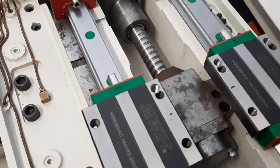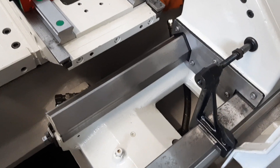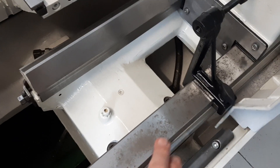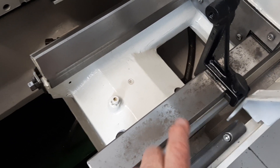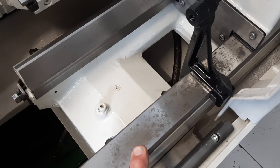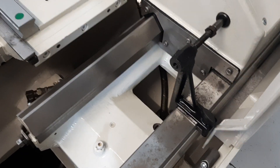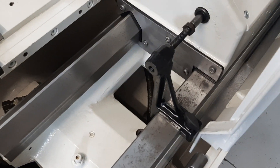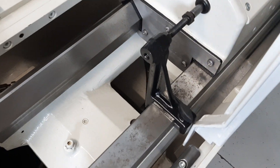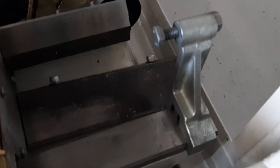I've just taken you down to the tail stock now to show you some other things. Not much else has really changed on the machine. I've cleaned these up, I've stoned these surfaces, which you guys have seen in the other video. Some of it's still a bit etched away - I couldn't go down too far. I thought about maybe getting it ground but I didn't want to go crazy, because I probably won't use the tail stock that much on a CNC. But I wanted to make sure I left that option open. Just blasting and painting things - these are all being zinc plated first, and then painted over the top with black two pack.